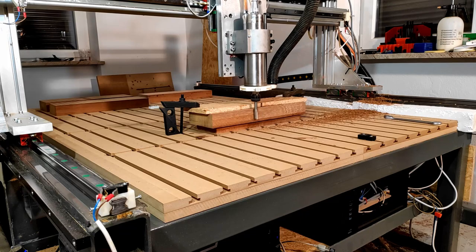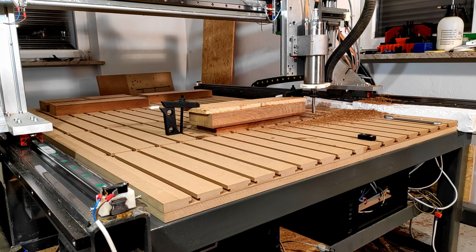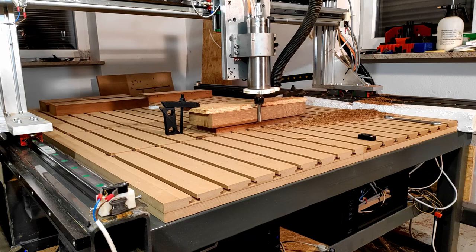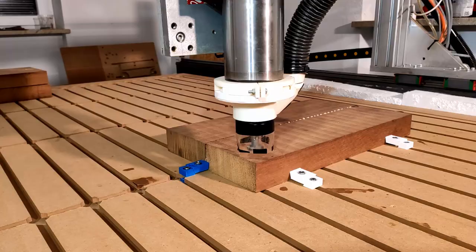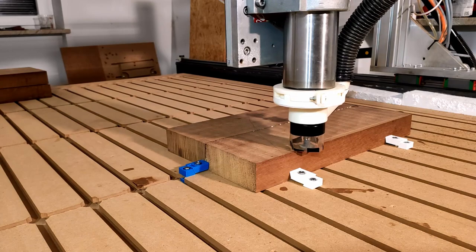After surfacing, we ended up with 1.5 meter long planks that we cut to length using a band saw. Later on, we prepared the edges for the joint using the CNC machine. To our surprise, it was working. Surfaces matched each other perfectly, allowing for easy bonding. After drying for 24 hours, we could start the next planing task, preparing surfaces for the next bonding.